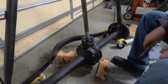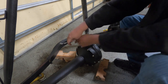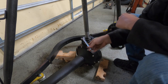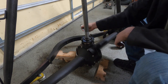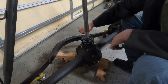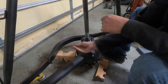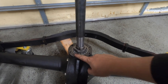Then you'll essentially do the opposite of what we did earlier — instead of loosening the nuts on the bottom side and pulling up, we'll be tightening from the top and pulling down. These are nine-sixteenths. We're going to go around to about a half turn each, just continuously working our way around. After a bit of effort, I finally got it fully tightened down — the bearing should be level with the flange itself.